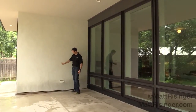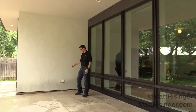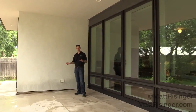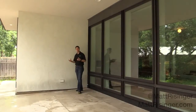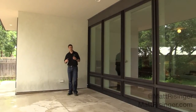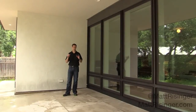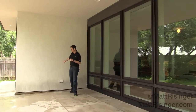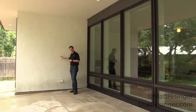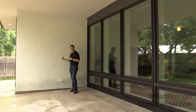This is a porous product. If you look at the bottom two feet or so, you can see how much darker that is. We just finished power washing this back porch and that stucco has soaked up a ton of water. That's the same thing that would happen on splashback, on a rain event, or if your sprinklers are hitting the house, which happens all over Texas and really the southern U.S. This is best practice now because this reservoir cladding is going to be able to dry to the backside or the front side.